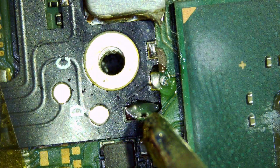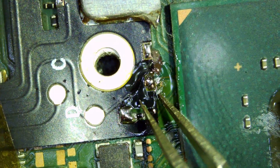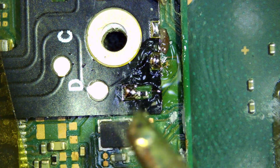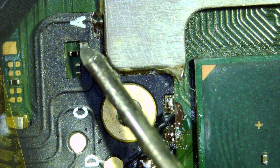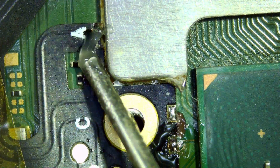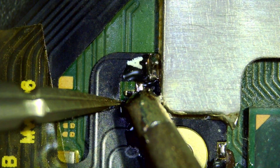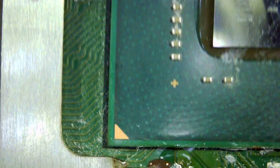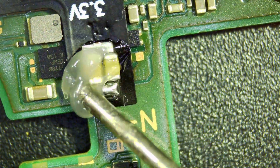Twist it around and get in the best position to solder. This is point D — the point you've scraped to expose a little bit of copper — so just solder to that. Use tweezers to gently lift it to make sure the solder has taken. Then add a little bit of solder to this cap here, making sure you get a good connection. The next cap just needs to be soldered too — give it plenty of solder and hold it down to stop it moving. This last one is just an earthing tab, so put a little bit of solder connecting it to the heat shield.